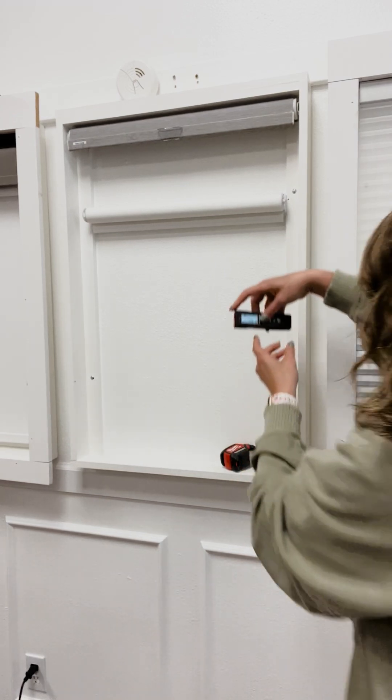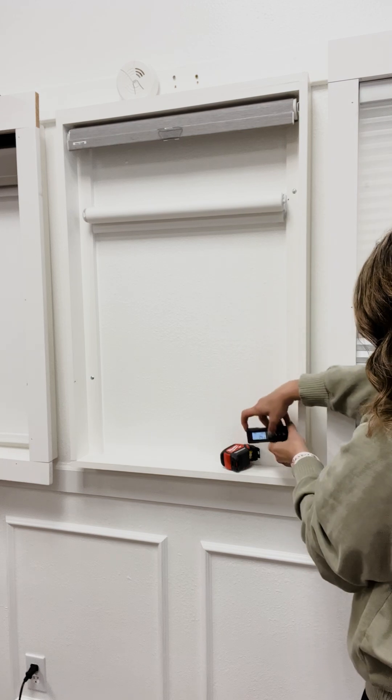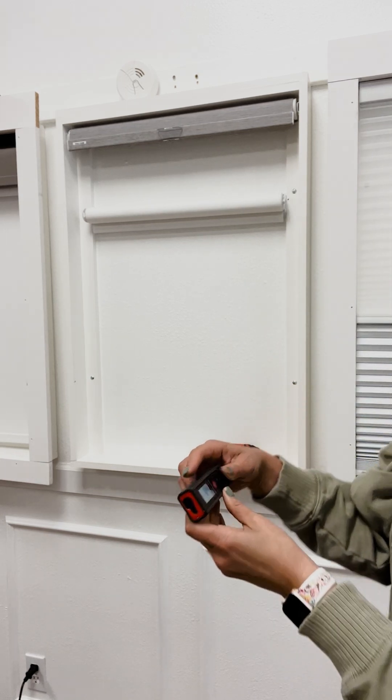Now I'm going to measure the middle and then the bottom, and you're going to see that it records two measurements at a time. So I already knew the top one, and then it's 24, and then 23 and 31/32nds. So the bottom is the smallest measurement. If I'm doing something rigid that needs to fit all the way down the edge, I'm going to use that measurement. For roller shades we'll cover this in a minute — you would just use the top measurement because of the gap along the sides coming down.